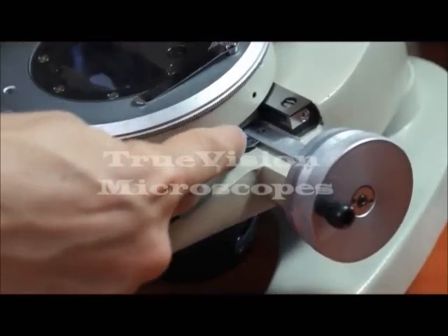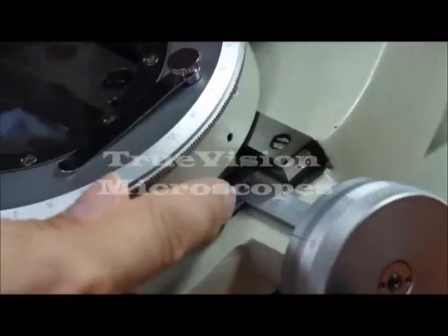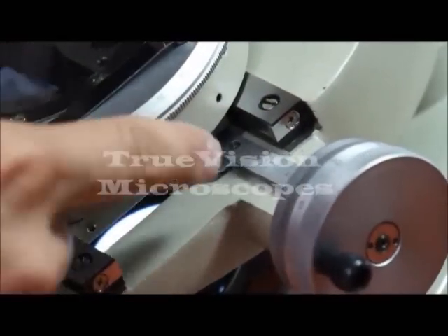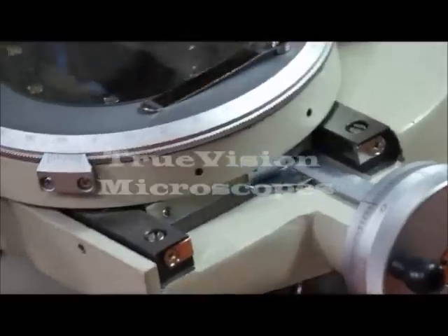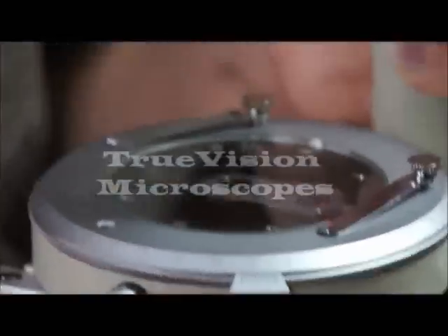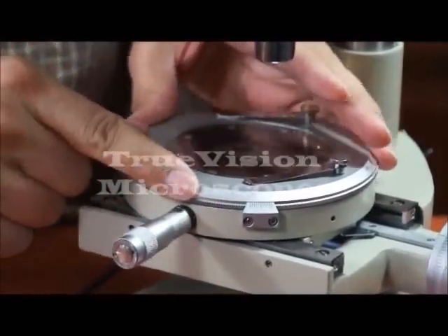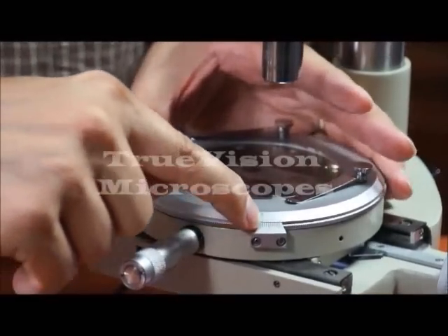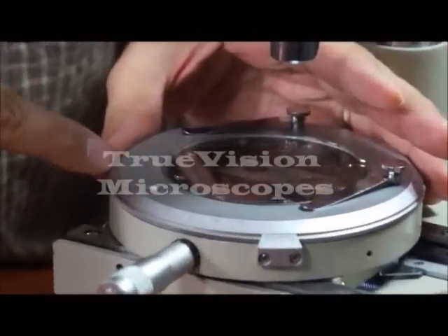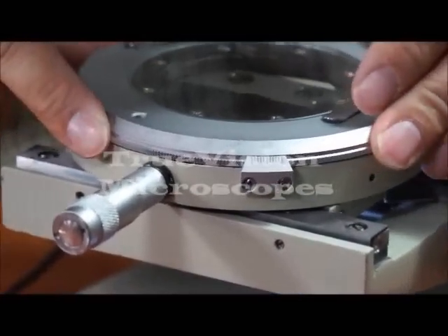You can also read off one full revolution. We'll advance in the X direction one millimeter across, from zero to 50 millimeters. The stage rotation is similar — zero all the way to 360 degrees with one degree least count resolution.